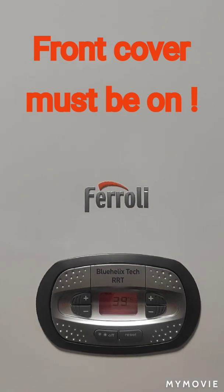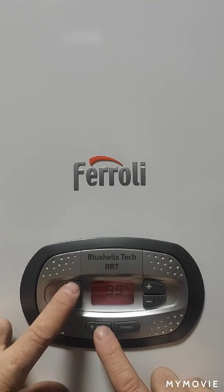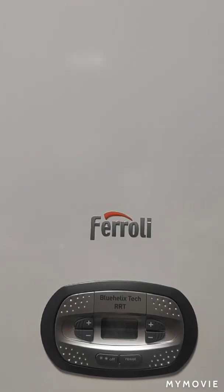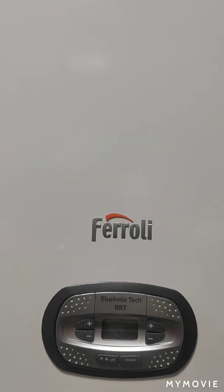Keep your finger on the reset button and it will go back to the normal screen. Then what we need to do — you must have the front cover back on. Press the off button and the plus button together, keep them pressed in, and the screen will change. This time it will come up 'Cali' — calibration. What this is going to do now is set the boiler up for whatever you have set it for — natural gas or LPG. You've got to have the front cover on; it's really important. You're going to test the boiler with the air in the room — a complete test — so it starts testing the actual flue and the integrity of the flue as well.